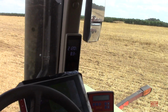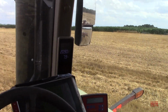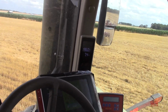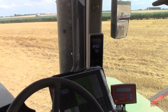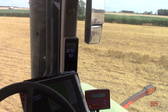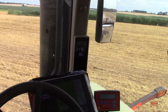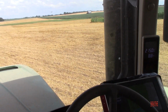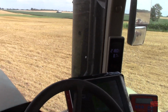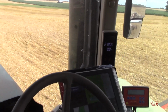What do you like about running with a big air drill like this versus running a planter out here? You're planting 30-inch rows in soybeans right now? We are. What advantages does the drill give you versus running just a regular corn planter on beans? I like the hoe drill because I don't have any straw down in with the seed. It blows it out. And how many acres can you cover with a big drill like this before you have to refill? Well, I normally don't put but about 450 in it, but we can plant 400 to 500 acres. Oh, that'll cover a lot of ground.